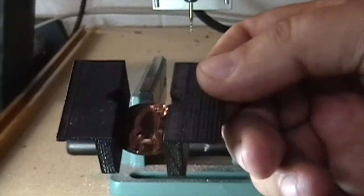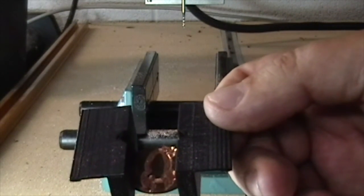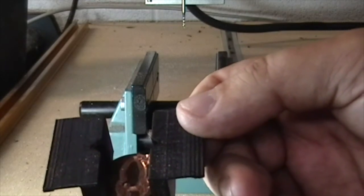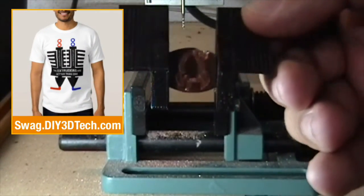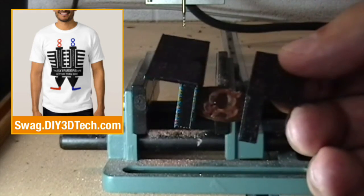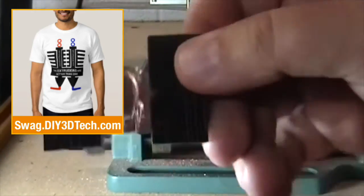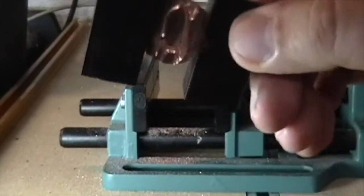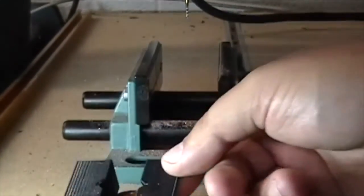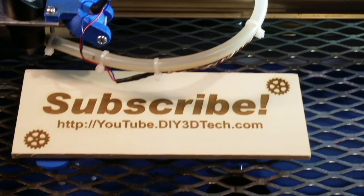I think I need to slow it down — I think I'm getting too aggressive speed-wise. I'm running 80 millimeters per second at a 0.05 millimeter cut pass, which I thought would be okay, but I'm going to have to slow it down substantially — drop to at least 50 millimeters per second. So I'm going to call it for the video today and come back in another video after doing some experimentation offline. Once I get one done I'll show you guys. Thumbs up, subscribe, see you in the next video — cheers!